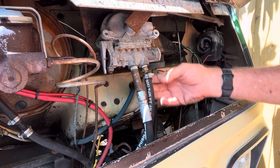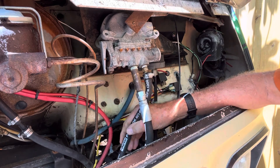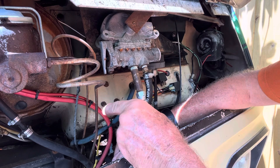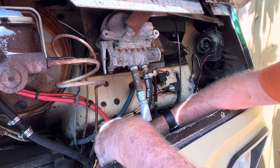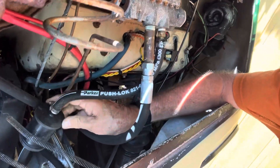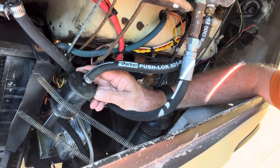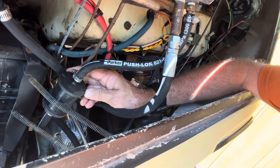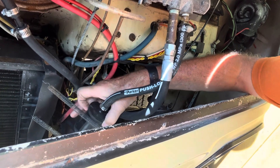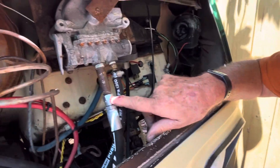So first thing: if this hose is old and cracked, this is a standard three-eighths hydraulic hose. You can get about three to four feet of it. Down at the pump it's also got a clamp on it, so if you go down there and take that loose you'll see how long it's going to be. Another thing I suggest — right there — this is a filter. This is a transmission filter made by ATP, and I think the number is JXT160 or something like that. This filter will be at the end of the work because this is the low-pressure side, so it's filtering going back into the reservoir. That's a better place for the filter than where the original one is.